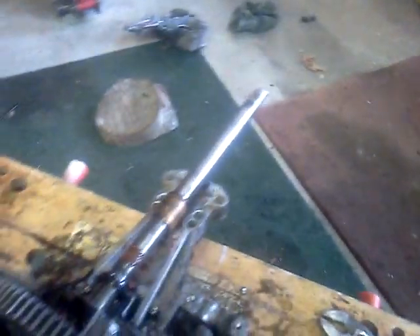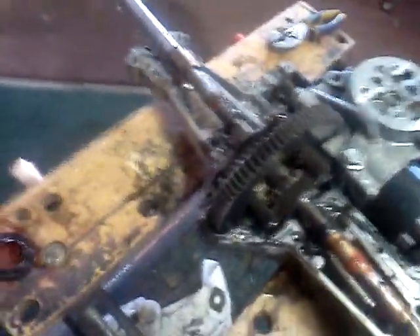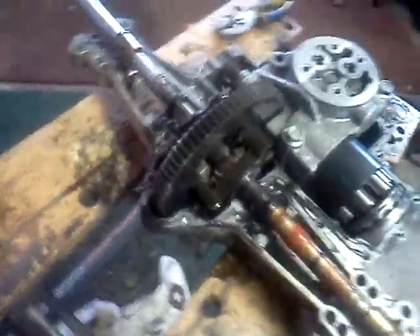While it's going on a jack like it is, if I put this back in, this will set it back in, and that wheel would spin twice as fast and I could hold this one still — just while the wheel's on. It's mainly one wheel; it's not a solid differential in here.